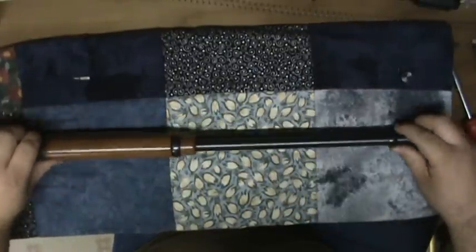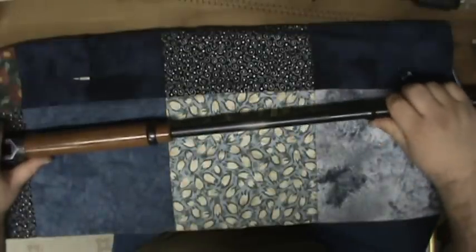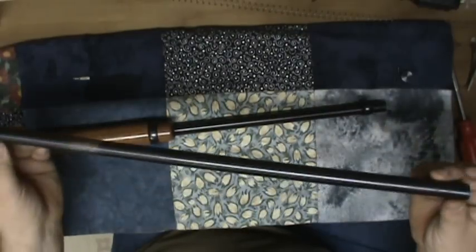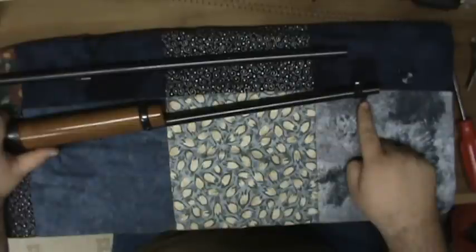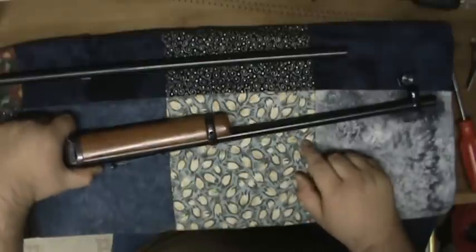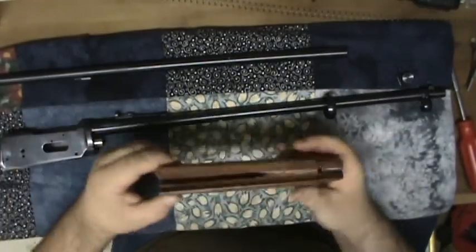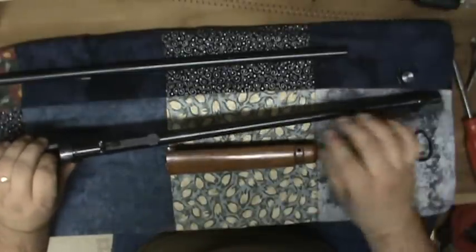The next step is to wiggle all the parts loose. You should be able to move your magazine tube out right now. Make sure it's clean and free of oil and grease inside. You're not going to be able to get this little band off because of your front sight, but you will be able to get both the forearm and the other band off as an assembly — just slide both of these forward. The forearm slips right off, and then you can wiggle the band off like that. That's pretty much how you do it.